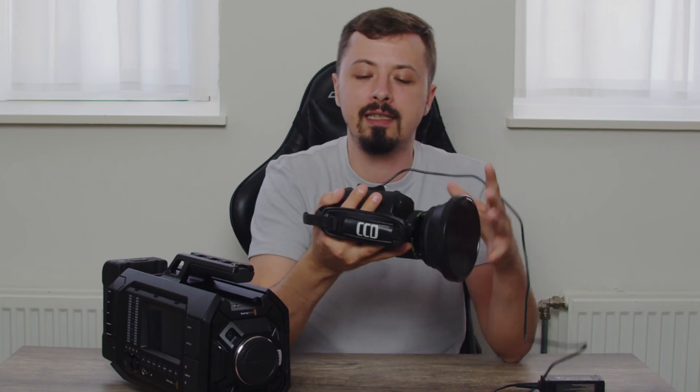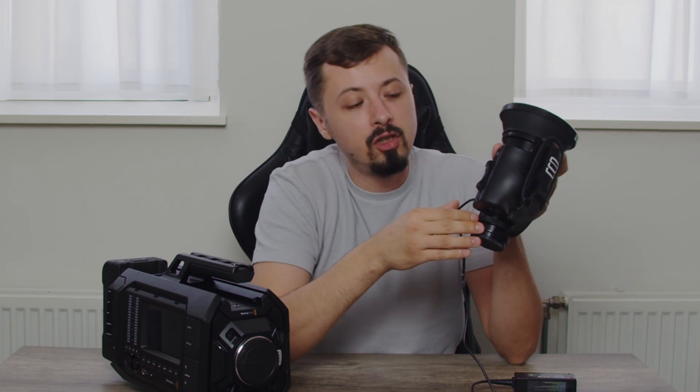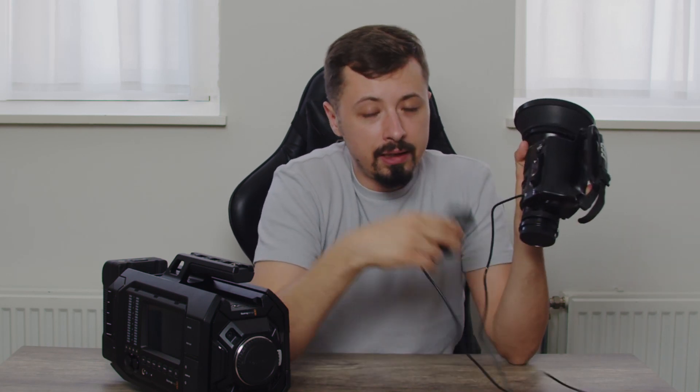This is the broadcast lens I was talking about last time. Since you last saw this lens I had to do some modifications on it. This is a really old JVC zoom control — I could not find any adapter or pinout information about it, so I opened it up and connected a 12-volt adapter directly to test it. It works perfectly.